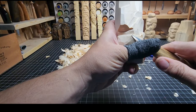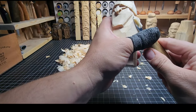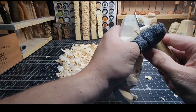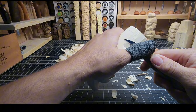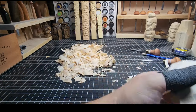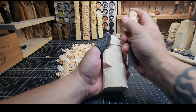Saw marks will not take paint or stain the same way as spots touched by a blade, so you don't want to leave those behind. Get them all off the entire carving. In some spots we want to keep those facets and knife cuts — they look really good once you start dry brushing — but we don't want them to be too sheer. I'm taking those saw marks off the front and smoothing out those hard lines around the bottom of this robe.